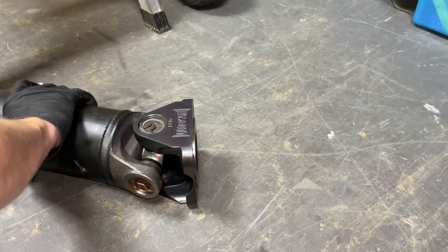We need to put a safety guard over the engine block in case a rod blows off and it doesn't come out and hit people. So I made a template out of cardboard, then I cut the cardboard out of stainless steel. Next, we've got to drill some holes. Stainless steel is quite hard and difficult to drill, and these are the best drill bits that I have found and I love drilling through stainless. Look at that, straight through. So you've got these plates all cut out now, got this bracket here made. And next, we've got to weld up the kickback.